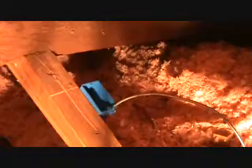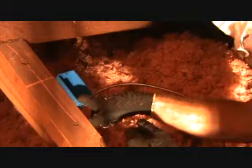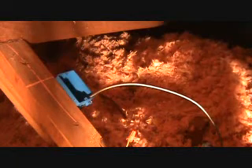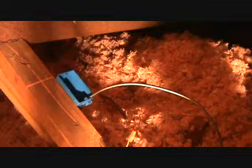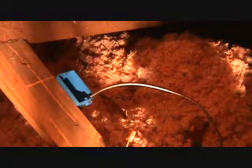The reason is I can't get down into the existing light switch box, so I've got to tie into that other electrical line that's up here. I've got to get a new wire from here — 12/2 with ground. I determined that by looking in the electrical sub-panel box: the breaker was a 20-amp breaker for this whole area, and on a 20-amp breaker you run 12-gauge wire. They have 12 gauge and also 14 gauge — 14 gauge is for a 15-amp circuit breaker. I can look at this wire and tell it's a little bit thicker and stouter than 14 gauge, so that's why I got 12/2 with ground at the store.